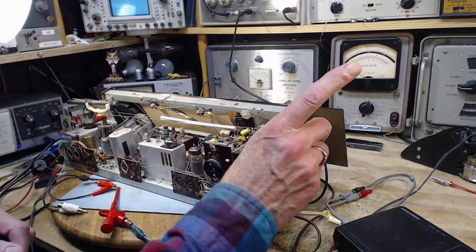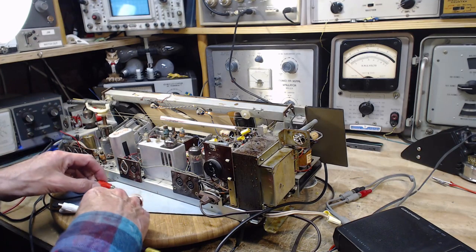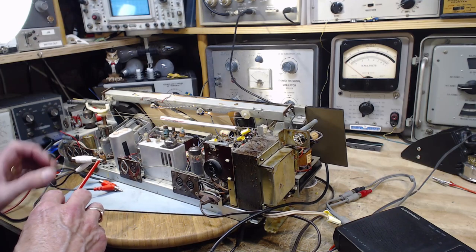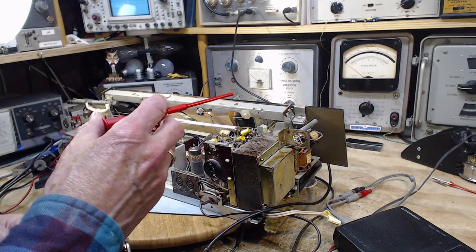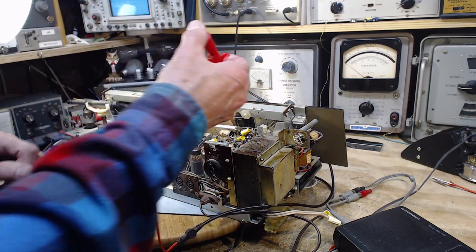So that's this channel up this way, not the speaker up that way. That's the other speaker, not much coming out. Okay, now we're going to inject the same signal into the output of the volume controls and see what we hear. There we go.